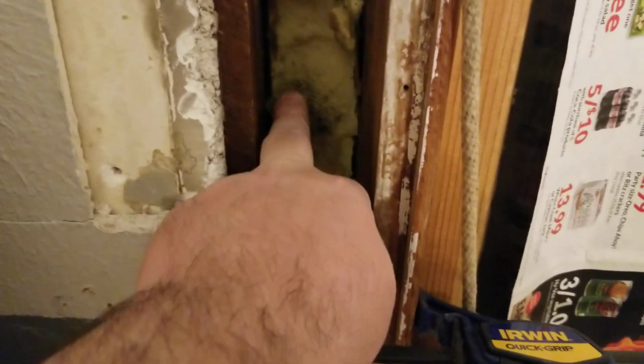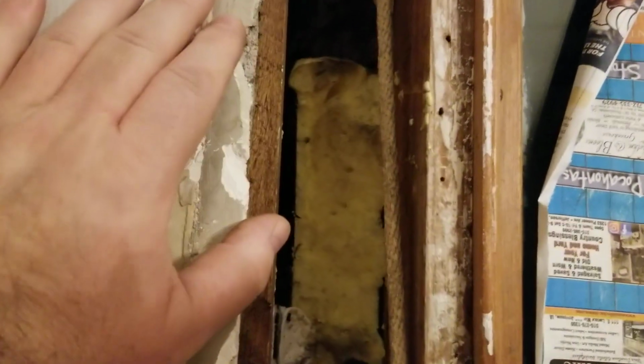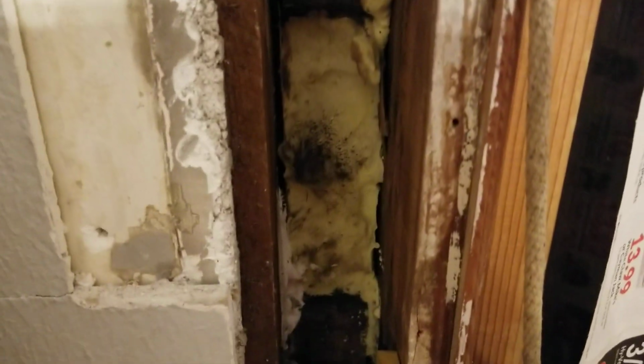This is from the weight rubbing against the insulation a little bit, which is fine. I'm not worried about that. Once you get done doing the spray foam, it's going to billow out and it's going to be all the way in the cavity. Then you can just take it and basically peel it off. You can use your fingers, or if you want to use something else to cut it, you can do that and get it level so that the weights have somewhere to go. Because if you just leave it spray foamed out like that, it's going to cover probably half the cavity, and you'll never get a weight up and down that. You'd just be beating the crap out of it with a weight. I mean, a weight like that in there needs room to move.